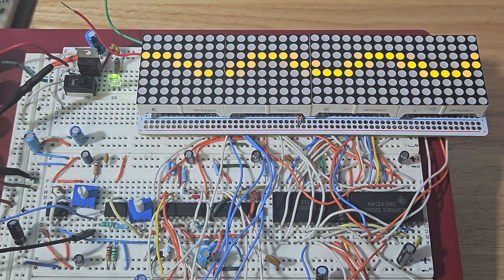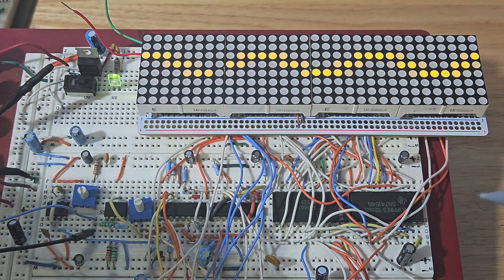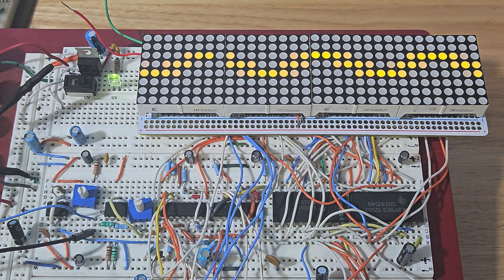Now on the dual color, dual channel oscilloscope I'm using an A-to-D converter. I'm going to show you three different oscilloscopes built three different ways. This one uses comparators. The second one is going to use an LM3914. The third one, the RGB three-channel one, is going to use an A-to-D converter. So we go from basic to mid-level to a microcontroller-based oscilloscope.